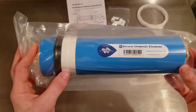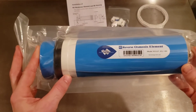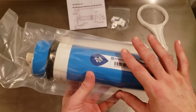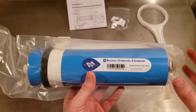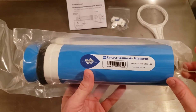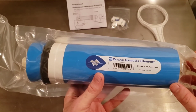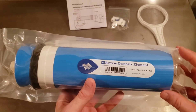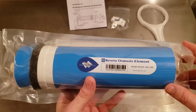It's important to keep this membrane dry and clean before you use it, and once you do start using it and it is wetted, it has to remain wet the entire time. I've got a lot of other videos on initial use and flushing these membranes — flushing them after every time you process sap, as well as how to do an end-of-season cleaning. There'll be links to those videos.